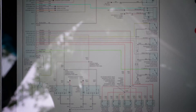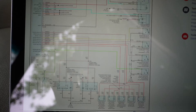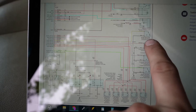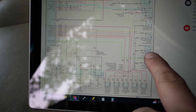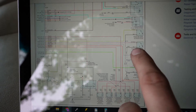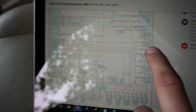Since the details may not come across clearly in the video, I'm gonna describe what each one is. We're gonna work on the driver's side front door ajar sensor. Below that we have passenger side front, passenger rear, and driver's rear. They each share a common ground, which is going to be black on each one. These wires are going to be in your door jamb.